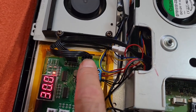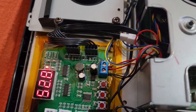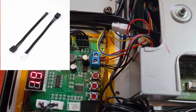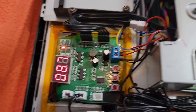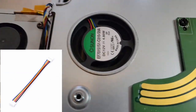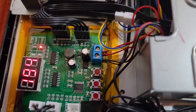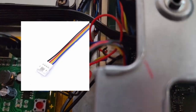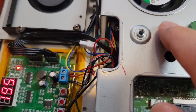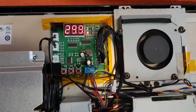These two converters are connected to the fans. I've used a converter which is a normal PWM connector to a mini connector - I'll put the link on each part I bought from AliExpress in the description of the video. You're going to need this board, two of these converters, and two cables. I haven't cut anything or soldered anything from the original fans - the original fans haven't been modified. I just cut one side of these two cables, taped the yellow and blue ones, and use the power coming from this board to power this controller.